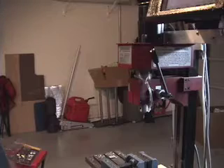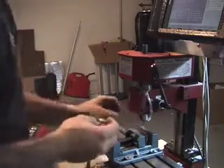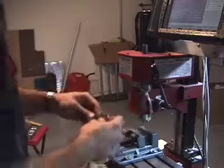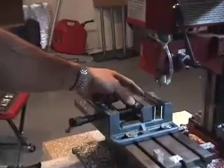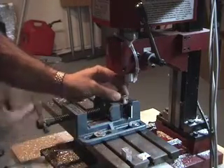I'm going to turn on the hobby CNC board. We have these two pieces — we need to make the final cut in them, which is on the side. There's two; I need a left and a right, so it's two different G-code programs. I know with this G-code program that I wrote where we have to line up the bit in relation to the part. You might see these look familiar — they're parallels. I just had to change some configuration in TurboCNC because I was playing around with it the other day.